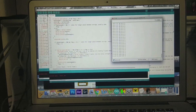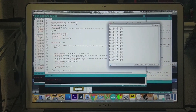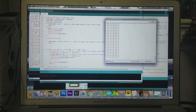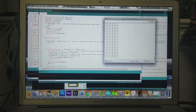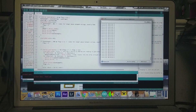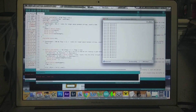The code looks for a byte gap longer than 40 milliseconds. Once it finds that, it reads in seven bytes, fills up an array, and then prints them. Now I need to test it on the actual TCU and see what kind of timing it needs. The tricky part is it runs at 500 baud, which is odd, so I can't use the built-in serial monitor — I'll have to use Putty on the laptop.